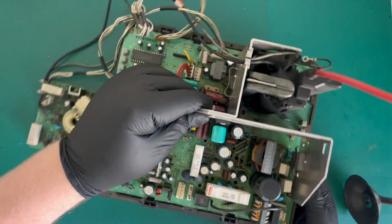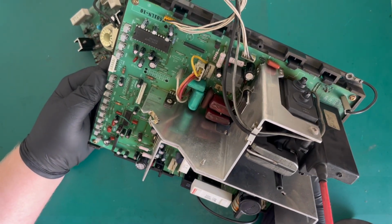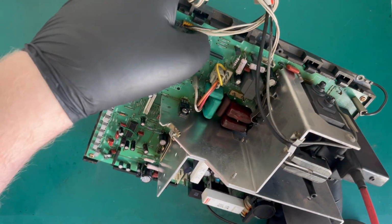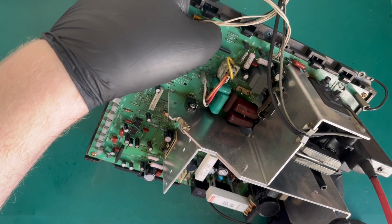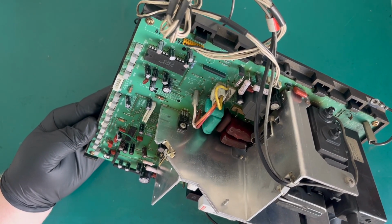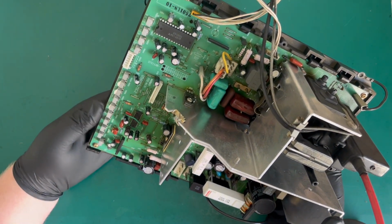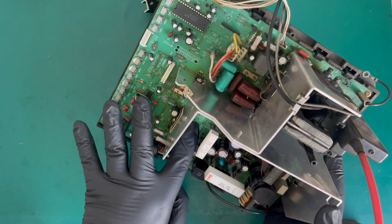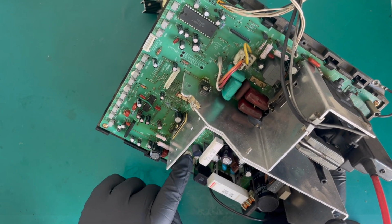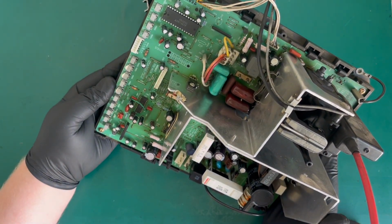Like I say, this does look very clean. I'll just have a quick little scout at it. I think the interesting thing is there are some examples, like there's a capacitor point there that's actually left empty on mine. So that must be a variation of the MS9s for some reason. I don't know if there's any other examples of that. We can see there's a coil that maybe would have sat there that's missing. Things like a resistor there, there's some diodes. So obviously there's variations of this chassis.